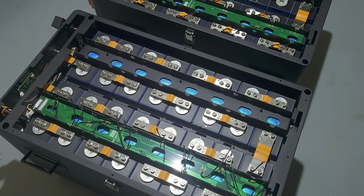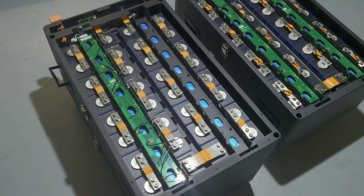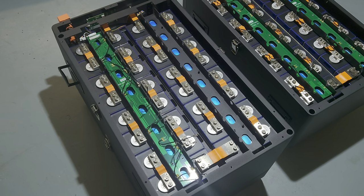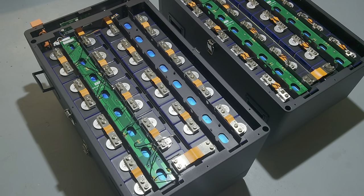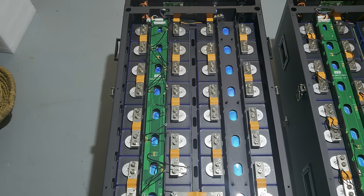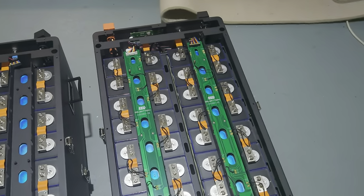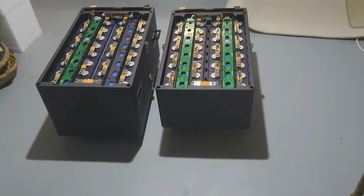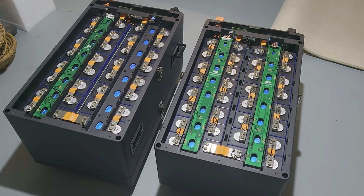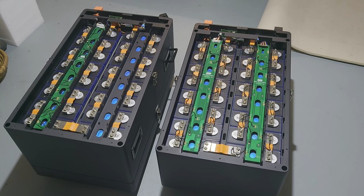I'm in contact with EEL about this. I just want to let you know: if you are building these packs, look carefully at those solder points and decide if you're happy with them. If you have any sense for batteries and electricity and the power they can produce, you will not use these balance boards as-is, because they could get your house burned down. That's it for today — a short explanation about the new versus old balance boards and the issues I've found. Thanks for watching, see you soon, and happy solar energy harvesting!